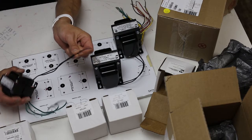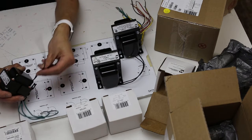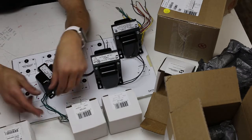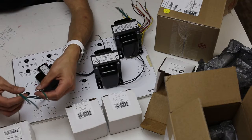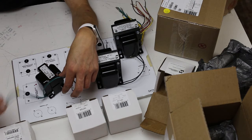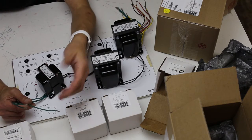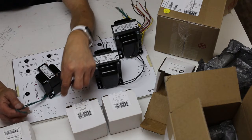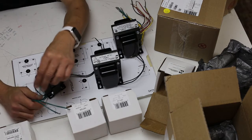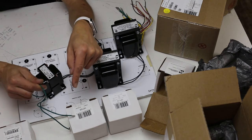Black-black is AC mains. They do not indicate which is the high lead of the winding on the schematic diagram, so on all of the small transformers you will not ground the center tap. On this particular transformer, green-green is 6.3 VAC and will go to the PCB. Green-yellow is the center tap — you will not ground this. If you do, it'll blow the rectifier diodes of that section and maybe some other stuff. This will be isolated. You can use the PCB spot marked CT, which is isolated, or use a spade connector on an isolated barrier strip.